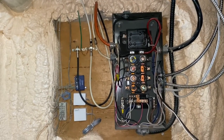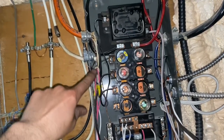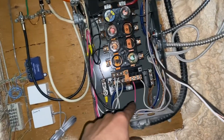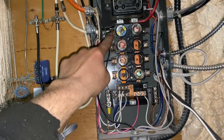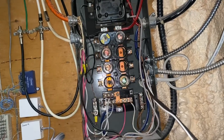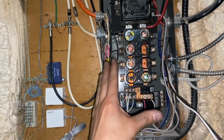If you want 120 volts like a normal plug-in, the black wire goes through a fuse into one side, and then the black wire and a white wire together create 120 volts. You can see all the black-and-white pairs around the panel — those are all 120-volt circuits. But if you combine the black wire and the red wire, you get 240 volts.